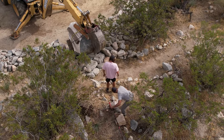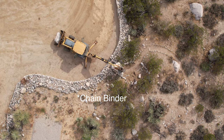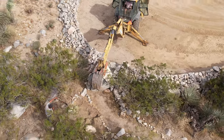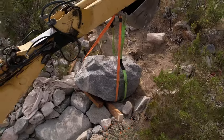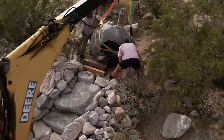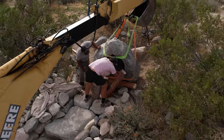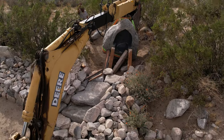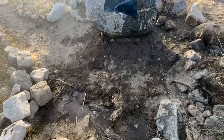I just went as slow and careful as I could — thank God those chains held. This was a challenging way to do this, and it would have been ideal before the fieldstone walls were in place. I was grateful that the turnbuckle was able to apply enough tension to the chain — that transport chain is rated for about 8,000 pounds so it held true to its rating. We inched it up little by little until the controls just stopped working because it was past the weight capacity. I was able to get the straps rearranged, get it off the chain, and use the extender hoe to push it back. I would file this one under 'should have used a crane.'